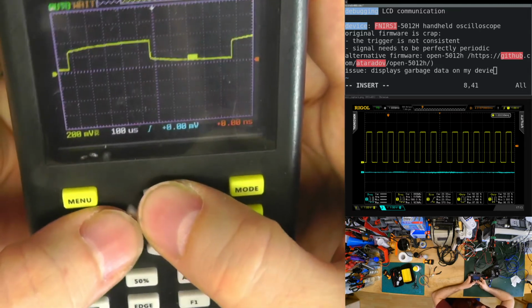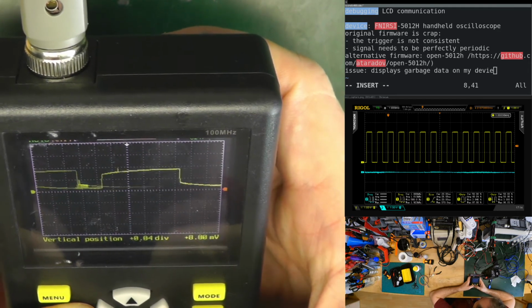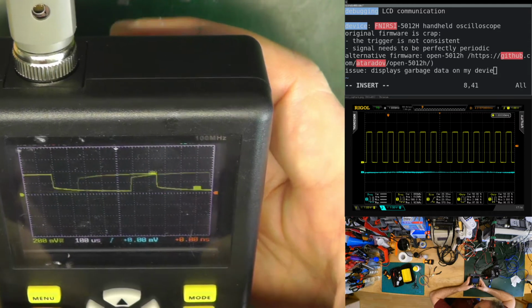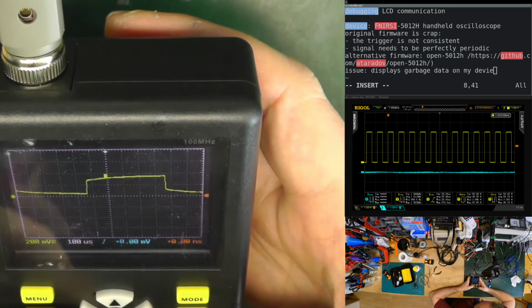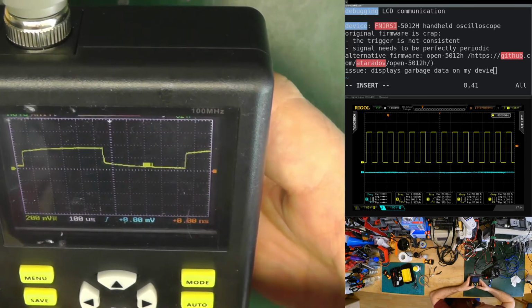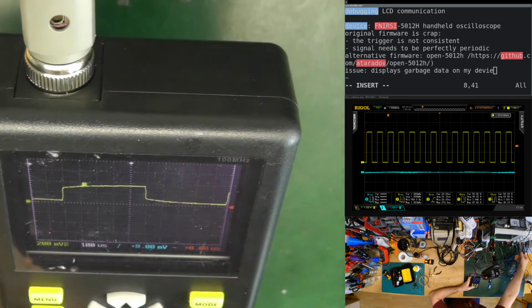Now it is connected. Actually it's really useful. So now let's move the trigger point. No, that's the vertical position we don't want. So mode maybe? No. I've never used, here, 1 time, 10 times. Okay. I'm not sure. Okay, the AC/DC button works, but the 1 time, 10 time does not work. So it only works for 1 time probes.